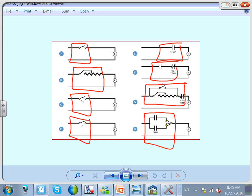If your fans are fraction horsepower or smaller horsepower, you don't need, guys, a disconnect by code for it. The fans I use there, you do not need a disconnect for them by code. If it's fraction horsepower, you can depend on the circuit breaker to be your disconnect. If they're bigger, and I think it's a fraction of a horsepower, less than a horsepower, you do not need a disconnect for that. Okay, so these are your control methods for them.